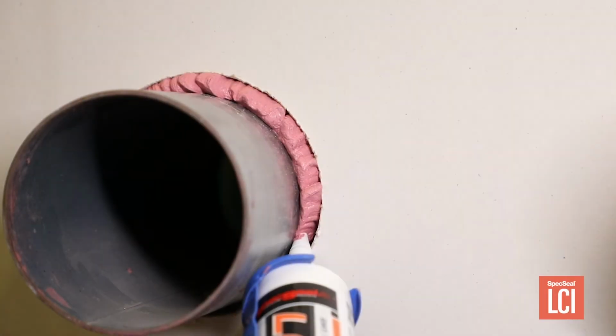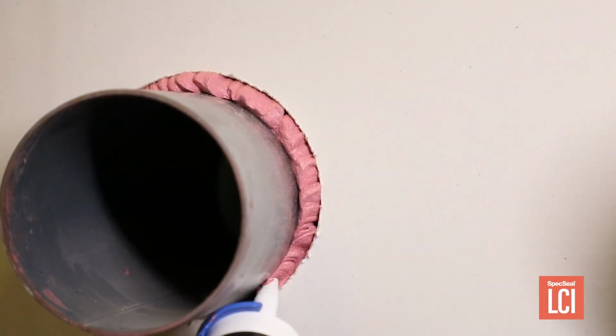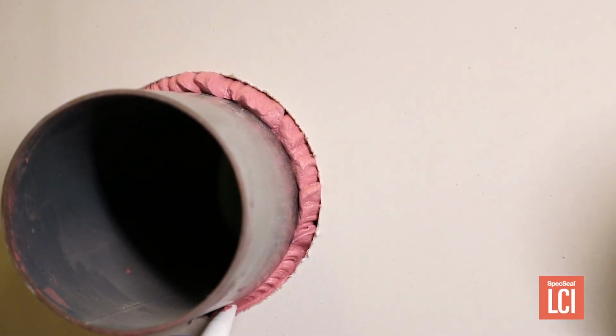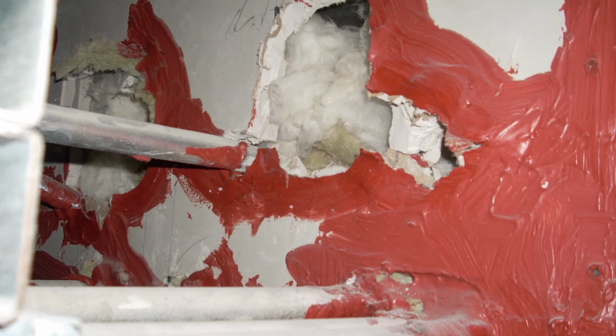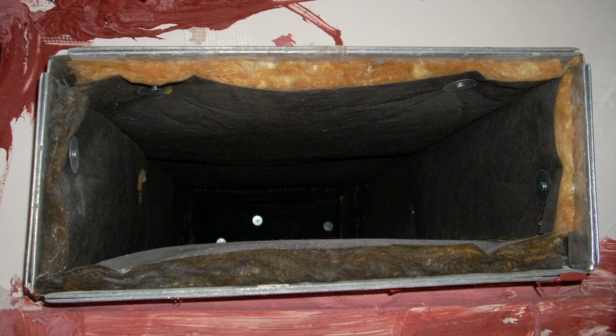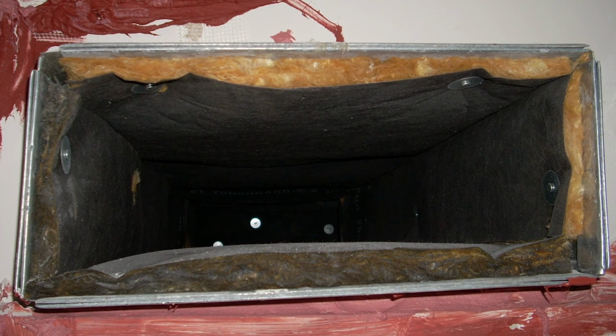Number 5, install the sealant. Sealant must be in the plane of the wall or floor completely and fill the annular space. Firestop material just smeared on the surface or piled up across the face of the opening will fail inspection and will fail during a fire.